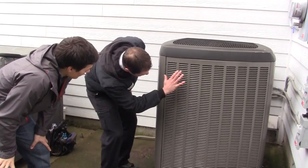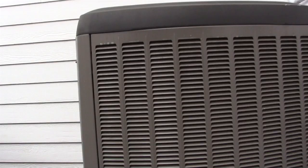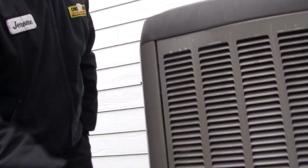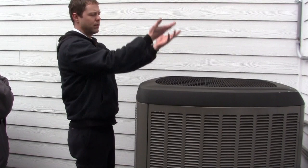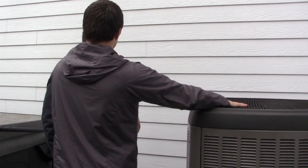You can see here the coil is rather large in this particular unit. This whole thing is a coil right here, and it's really going to be behind this louver, which is mainly there to protect the coil itself. The coil wraps all the way around. It takes heat from the outside and pushes it into the house using the fan motor on top to pull heat in through the sides through the coil, pushing the colder air out of the top.